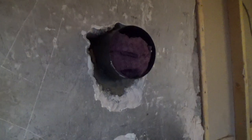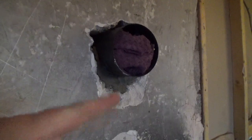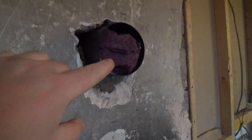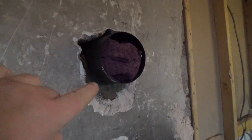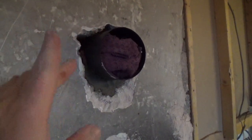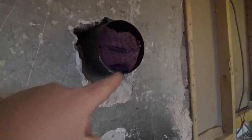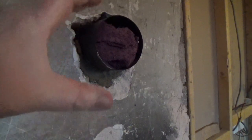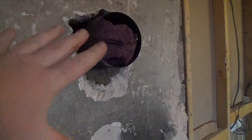And that's that done. The pipe that's in there isn't permanent — that's just a short section, about a foot or so, that I've got from elsewhere in the ducting. I got a wet render mix and basically skimmed the entire inside of the hole there, so that's completely sealed with no capacity for leaks outside of the chimney lining. So that is now a single pipe running through. Then I put a little bed of a nice wet mix on the bottom there and just bedded that pipe down into it, because it's got the same profile as the 90-degree pipe that will go on here.